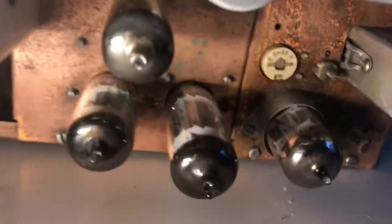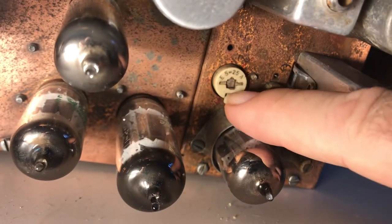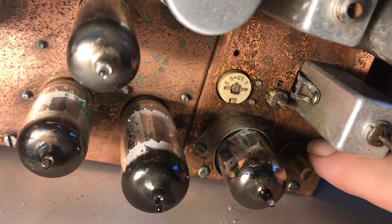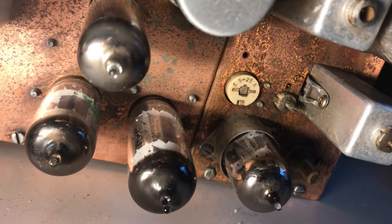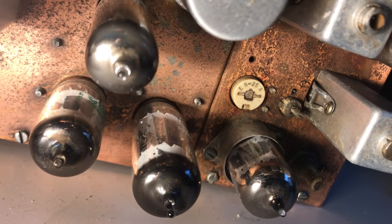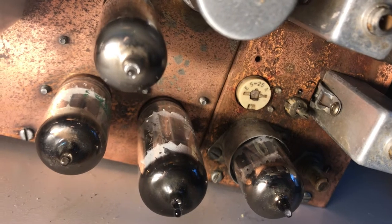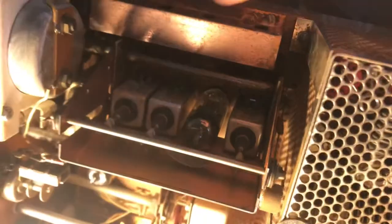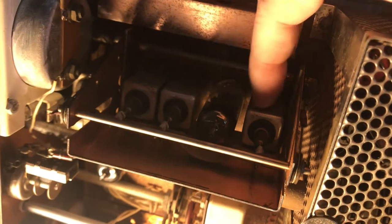So I'm going to focus on this capacitor — I think there's some salt on it — and the coil here; get those cleaned up and see if that crystal's oscillating. I think once I get that crystal going again, this thing will fire up. There are basically three signals that mix: from the crystal bank, from the VFO, and from this signal. They all three mix and then you'll get some output in the driver section.